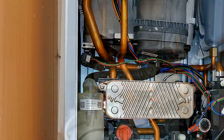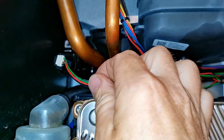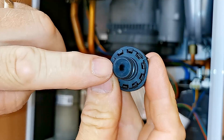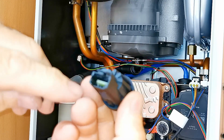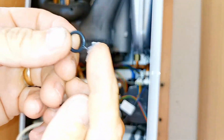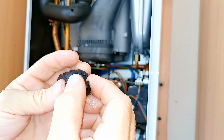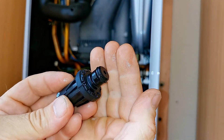Just over here on the left hand side of the boiler is the pressure sensor - this little device is causing all the problems. You can see the wire plugged into the sensor which takes all the readings back to the circuit board. Here I have a brand new pressure sensor. At the end there's a small hole where the water goes in and out, pushing against a small diaphragm inside the sensor, which in turn pushes against the sensor connected to the circuit board. There's a small o-ring on the end - I always grease that up with silicon grease and slip it onto the sensor. That's now all ready to be plugged in.